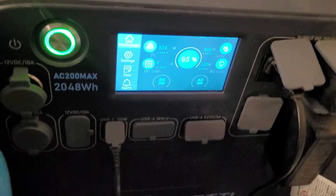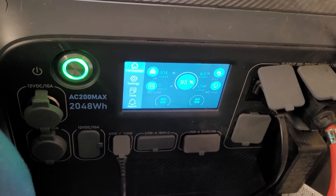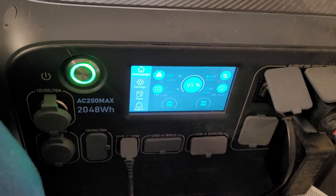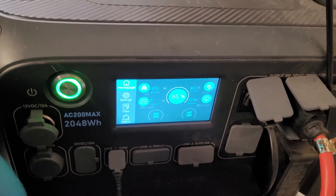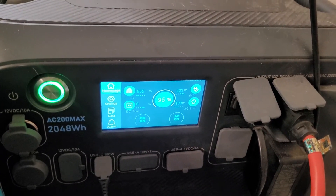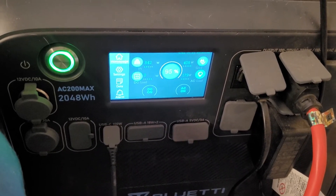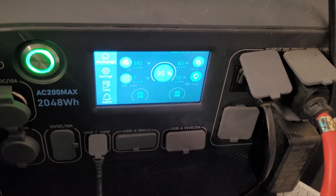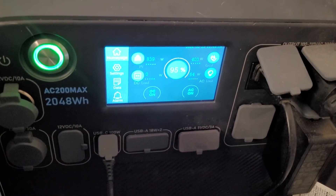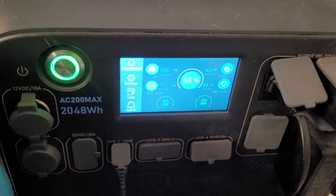I've also been thinking about setting up east-to-west facing solar panels instead of only south-facing, and doing a parallel configuration with 1000 watts on each side. That way when the sun is on the east side I'd still get 1000 watts, and when it's on the west side I'd still get 1000. I've been reading that east-to-west orientation gives a higher overall power rating, and with east-facing panels you're getting max power as soon as the sun crests the horizon.